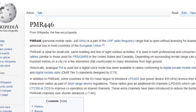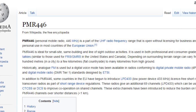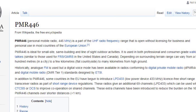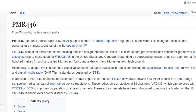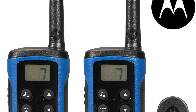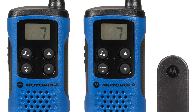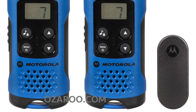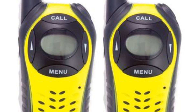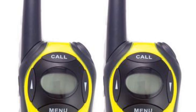Although the UV5R is a genuine ham radio transceiver requiring a license to operate legally here in the UK, most of these radios are reprogrammed to use on the PMR 446 band. The PMR band was introduced in the UK in April 1999, running from 446 to 446.2 MHz with a separation of 12.5 kHz. Originally there were only eight channels, but as of January 2018 another eight were added, giving a total of 16. For a PMR radio to be legal in the UK it must have an output of no more than half a watt (500 milliwatts) and a fixed antenna — the UV5R has neither of those things, so it is not a type-approved legal radio to use in the UK.